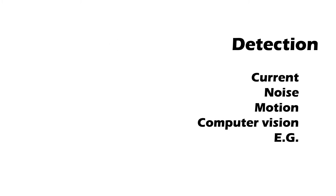Let's break our solution into two parts: a system for detecting the washing machine state and a system for notifying us of its state. A few methods we could use for detecting the washing machine's current running state: we could detect the flow of electricity passing through the power cables of the machines, use a microphone to listen for rumbling or even the laundry finished buzzer which normally we can't hear inside the house, use a piezo sensor or an accelerometer to detect movement or jostling of the machines as they run, or use a camera and computer vision to see if they're running. We're going to use an accelerometer.